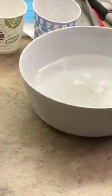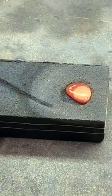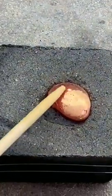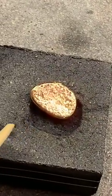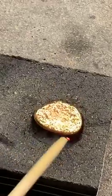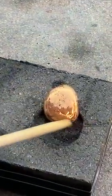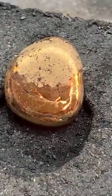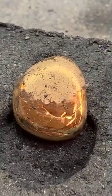The thing of it is, it will light the chopstick on fire when you poke it with this. It's not going to hurt anything — I usually just keep water there because it tends to distract people if you have a flaming baton. So you see all those cute little cracks? I think that's our hole right there, that little depression — but let's flip it over anyway. This one is relatively broad and shallow. Sometimes they're very narrow and deep, sometimes they're on the side, the top, the bottom. So just make sure next time you're checking for this, you're not expecting it to look exactly like this one. As long as you see one somewhere, you're in good shape.